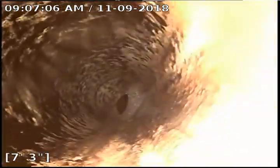So this is 101, and now we're going to go out away from the building. And we should hit a main. So there's a 45. You can see we're going to end up in some more soap suds here. So this guy's holding some water. We're going to try to push through it. So there's our drop to the main.